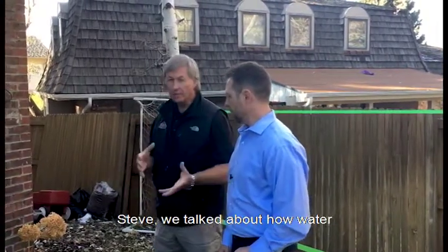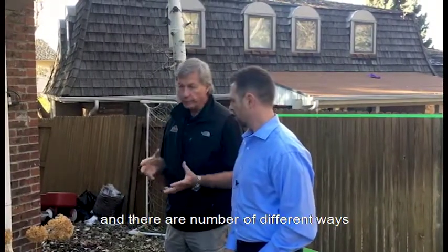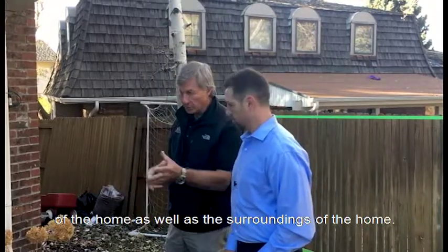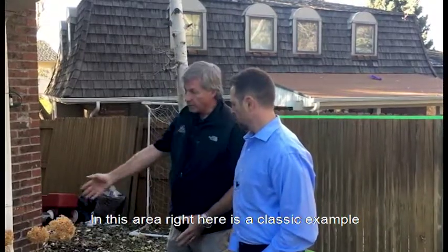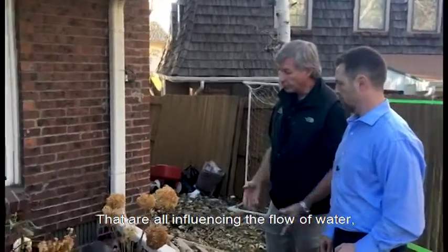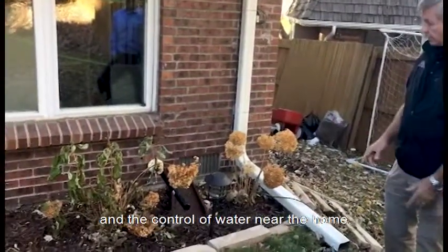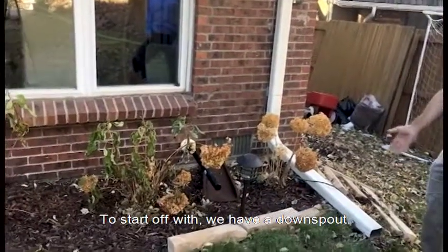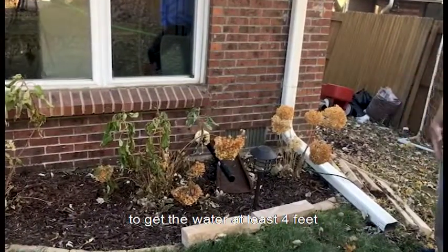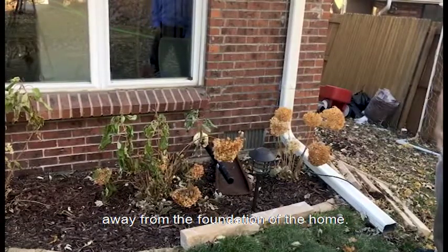Yeah, Steve, we've talked again about how water is such an enemy to your home. There are a number of different ways that water can become an influence on the structure of the home as well as the surroundings of the home. This area right here is a classic example of multiple issues that are all influencing the flow of water and the control of water near the home. Start off with, we have a downspout. It looks like there's a nice extension on here now. That's good to get the water at least 4 feet away from the foundation and direct it down and away from the foundation of the home.